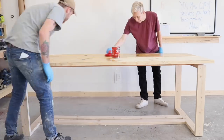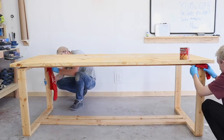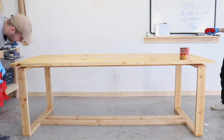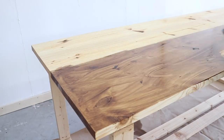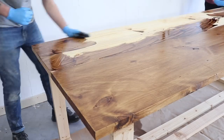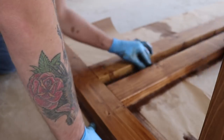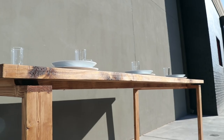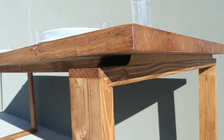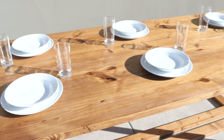Whenever you're staining a soft wood like pine, you want to make sure and use a wood conditioner so that the stain goes on evenly and you don't get a blotchy finish. I'll have links to everything I used down in the description, including this stain, which is Early American by Minwax. This was the first time I've used it, but I'm a big fan — you'll definitely see me using this again in the future. After a couple coats of polycrylic, the table was done. This table sits six easily, but could fit eight with one on each end. I think it would look really cool if you made a set of matching benches using the same techniques, just sizing everything proportionally.